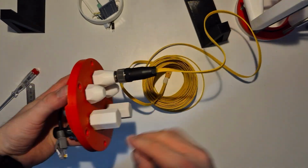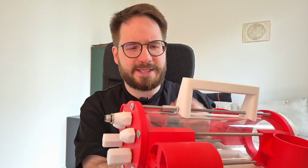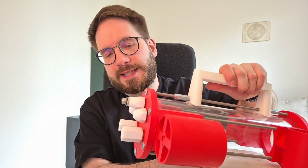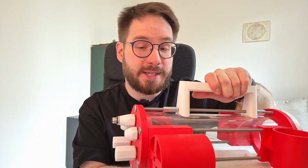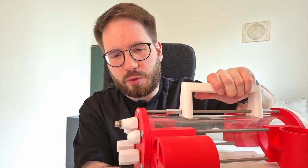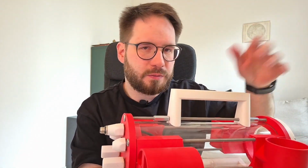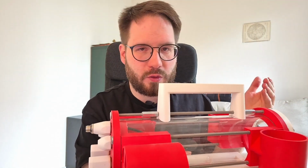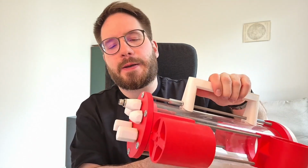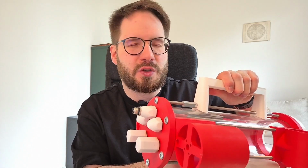Now, one more thing, since we mentioned the cable that is going to the surface, I think it makes sense to say a couple of words about why we're using the cable at all. The problem is that radio waves, surprise, don't really propagate well in water, at least the high frequency ones that we normally use to stream videos. Since I want a live feed from the camera, I kind of need the high frequency ones, and 2.5 gigahertz just won't work under the water.